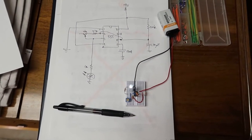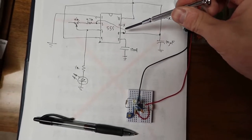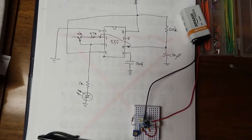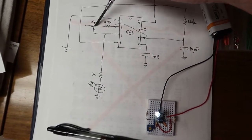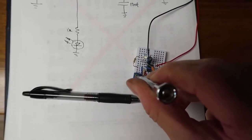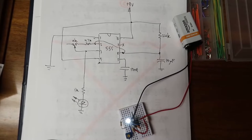For the strobe light I whipped up a quick 555 timer circuit. I hate the 555 timer — it's so overused and the pin layout is just nonsense; wires have to cross every which way. But I grabbed it because it's easy. We went with a 10 microfarad cap, and the timing is adjusted by a trim pot and resistor in series so I can adjust the blinking frequency. It's about a 50% duty cycle at this point — you can adjust that with other tricks, but it's not worth it.